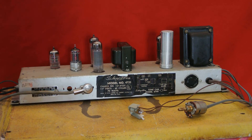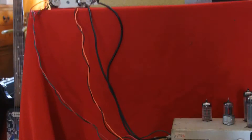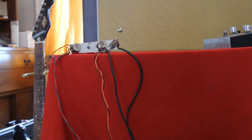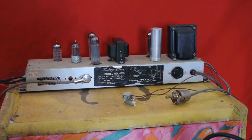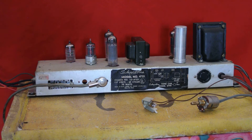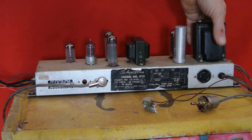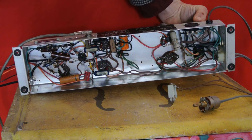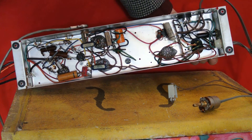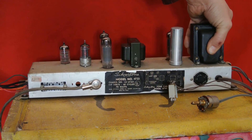We have set this amp up with a single volume and tone control, seen here, also with the input jack, in the manner of a Fender Deluxe style circuit. Some of you real hardcore amp guys might say that amp is only topless. Well, we can peek up under the skirt here so to speak. All point to point in this particular amp — no circuit boards.